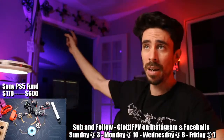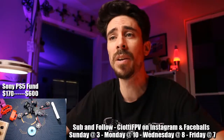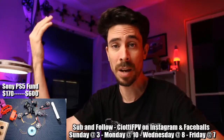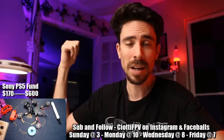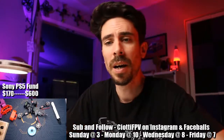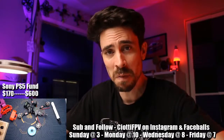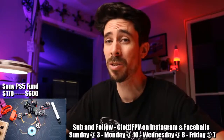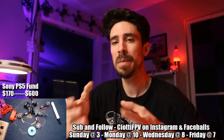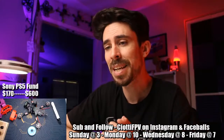My Dead Cat Glide cinema rig is on 2400 kV motors for 6S, motor limited down, so that I can put 4-inch propellers on it with guards. God forbid I ever need to fly really fast with prop guards on, I can crank it up to 100% motor limiting for that extra RPM for the 4-inch props. That's a little bit less necessary nowadays because we have 5-blade and 6-blade 4-inch propellers now. A 5-blade 4-inch propeller has roughly the same amount of blade area as a tri-blade 5-inch prop, so it's much less necessary to do that.